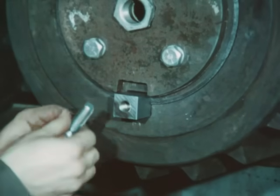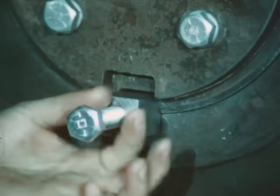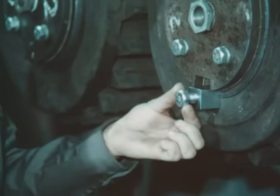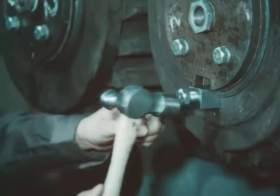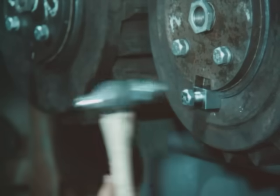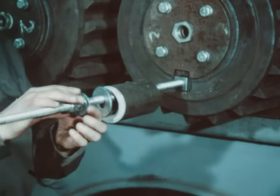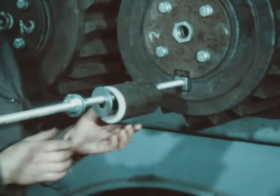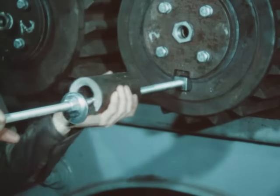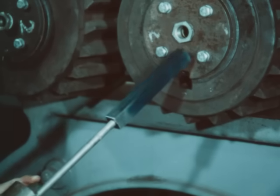The large end of the key has been drilled and tapped. A bolt placed in the threaded hole will protect the end of the key when it is driven in with a hammer. It will also serve as an aid when removing the key. With a hammer, drive in the key as far as it will go. Now the key has almost reached the proper depth in the keyway, and this will be the last fitting before the final installation. With a threaded rod and bumper, remove the key.